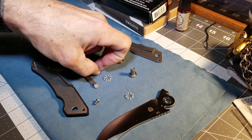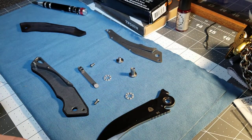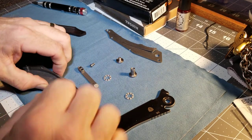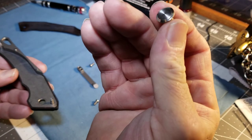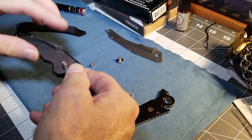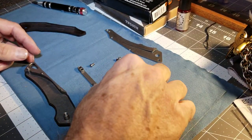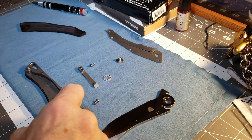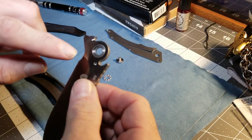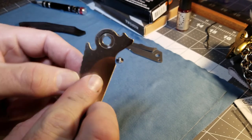Okay, now this is the knife stop, the blade stop that goes there like that. And if you'll pick this up as a unit and take your pivot screw from the back side, slide it up through in place, like so. Okay. You take one of these bearings, which I have pre-lubed with KPL. And as you can see, this blade is nicely oiled. You can see the sheen of oil on it. There is no trash on it.